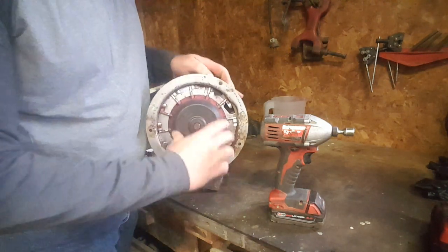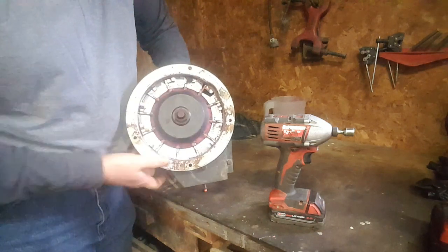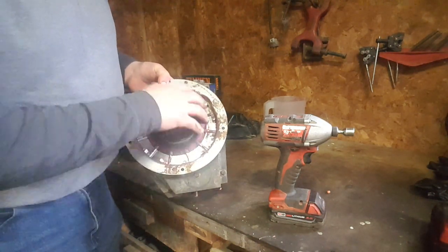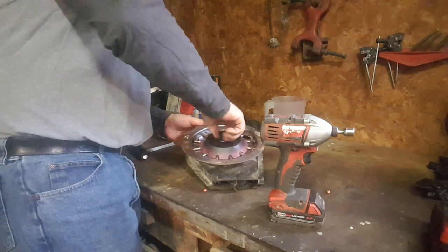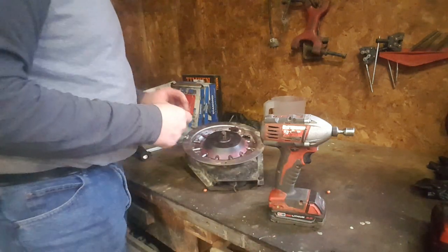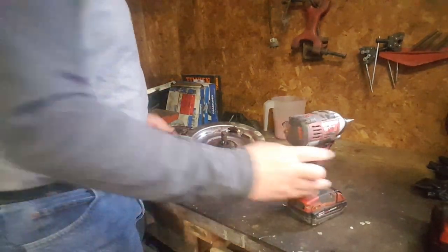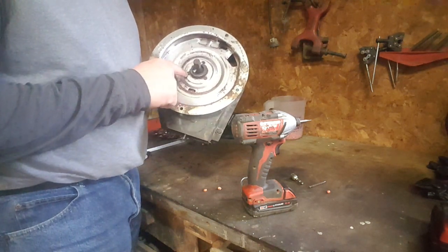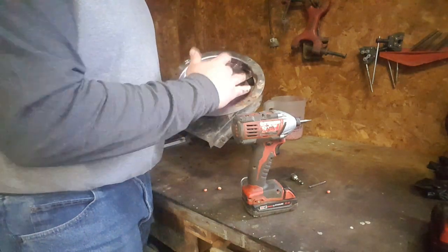There's our meter unit itself. The meter just rolls and flicks the seed in, and the seed just follows that belt down to the ground. We're going to look at these flags and inspect that brush. We pop that nut off - there normally is a retaining ring with a cotter key. It is not uncommon if these units have been sitting for a while, or if they've never been rebuilt in a number of years, for these little tiny flathead screws to get rusted in there.